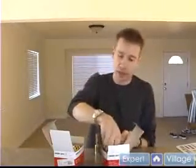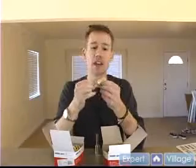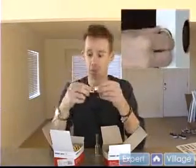The other thing you want to look at when choosing your deadbolt is the type of latch you're going to be putting in. If there's already a deadbolt, if you're replacing an old one, or you just want to make it quicker when installing the new one, you want to go with a drive-in latch. This latch here is a 1-inch throw, but it's just a punch in. All you do is drill the 1-inch hole and then just push it right in, and that's what secures it.